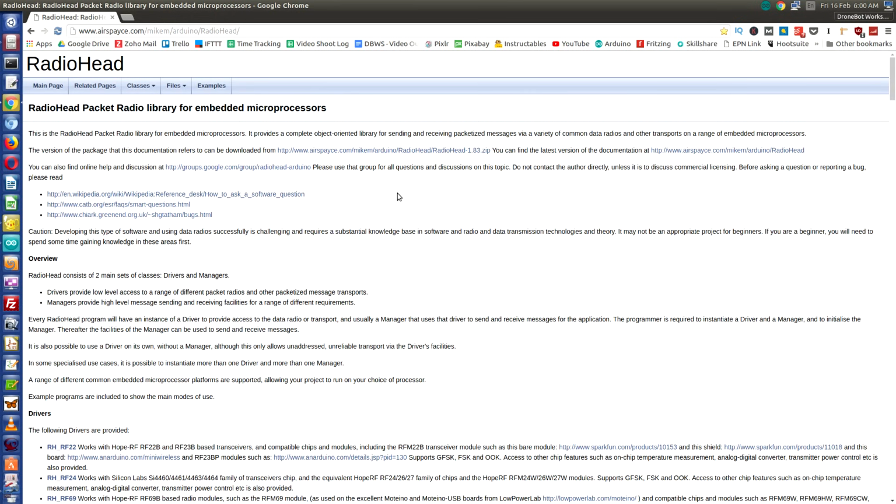Before we work with our sketch, you're going to need to obtain a copy of the RadioHead library. Unlike other libraries that we've used in previous videos, this library is not available by searching in your library manager. You'll actually have to go and download a copy from the website. I have a link in the article associated with this video so that you can get this library. Here's the RadioHead page, and you'll find the library right at the top over here. The current version as of this recording is 1.83, and it's available in a zip file. So download that zip file into a location that you're going to remember, and then head into your Arduino IDE.